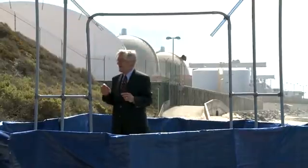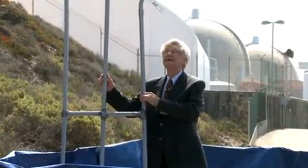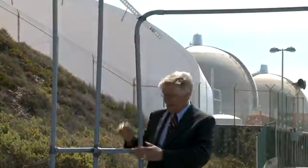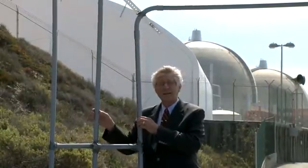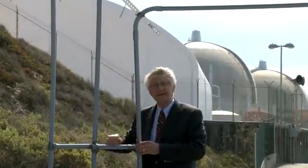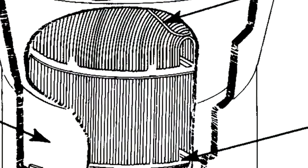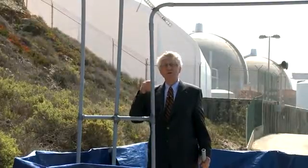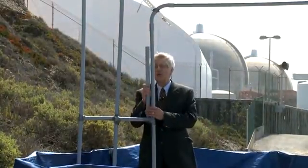What's happening at San Onofre now is that these tubes are vibrating. They're colliding with the pieces of metal designed to keep them separated. The vibrating tubes are hitting each other and hitting the support plates, denting the tubes. Some of the dents have gotten so bad that the pipe wall is completely worn away and the tube has to be plugged. We put these this far apart so we could show the U-shape of the tubes, but in fact they're incredibly close together.